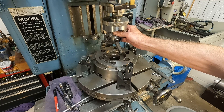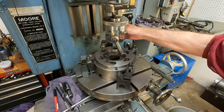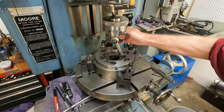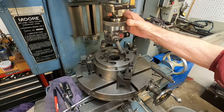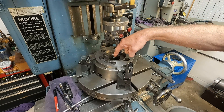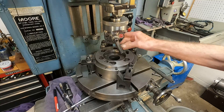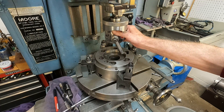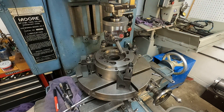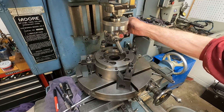This machine here is actually more accurate than the machines the chuck was made on. To set this thing up, you get the angle in, and once you hold this collar the slide feeds down. To put the tool in the right position it's on a taper here on this bar. To cut deeper, you move the spindle closer.